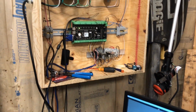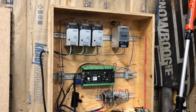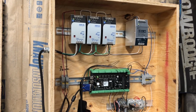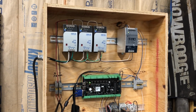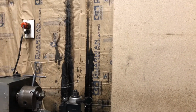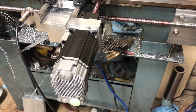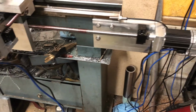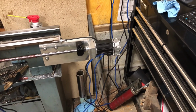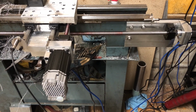This is our wooden panel, something to keep the dust off of when we get the door and stuff made. Up on the top left, we have 3 Allen Bradley power supplies. These are all wired in series to get us 72 volts for the Clearpath Servos. There's the Clearpath Servos. They're the NEMA 23s. I'll have to put the model number in the specs or in the description of the video.